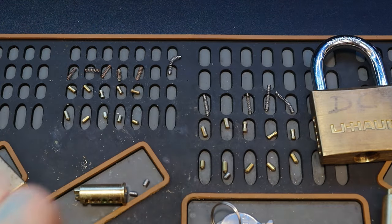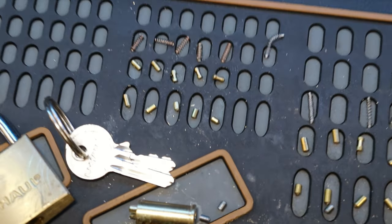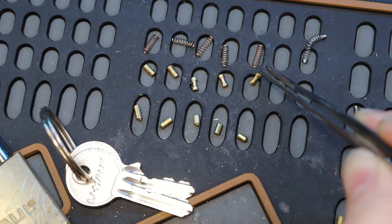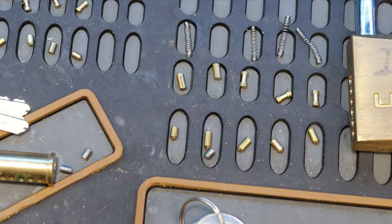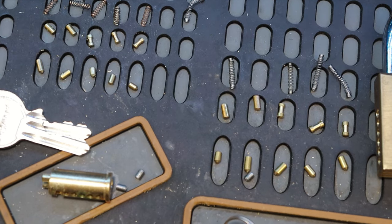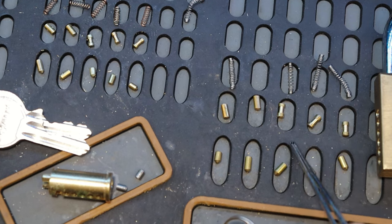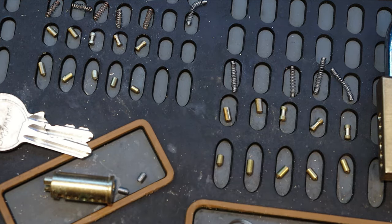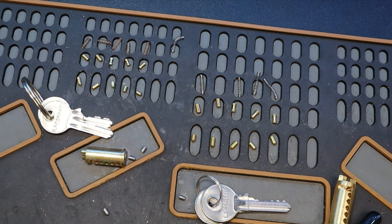So we can see that both — on the 40mm over here we have two spool, three spools on top, and all standard pins on the key pins, and those five pins. Our 50mm is the exact same: three spools on top and all standard on the bottom. It appears that maybe all the spools are in the last chambers — notice how on the 50mm they're all in the third, fourth, and fifth chamber, and same with the 40mm. So that could be a thing.